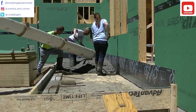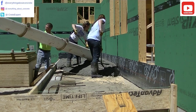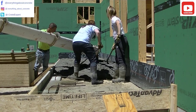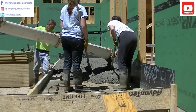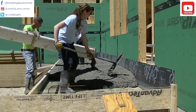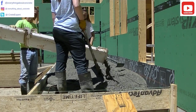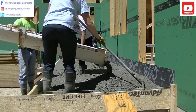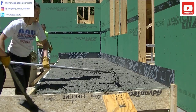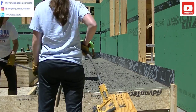You can see that red line on that black ISO strip there up against the wall — it's 10 inches thick right there. We'll get all the concrete poured in here. This thing is about 6 feet by 26. We're keeping the mix pretty stiff because of the slope — we don't want to pour the concrete too wet or it's just going to sag as I straight edge it and make it all harder to finish. We'll leave a little bit low on that back edge in case I'm high up there.